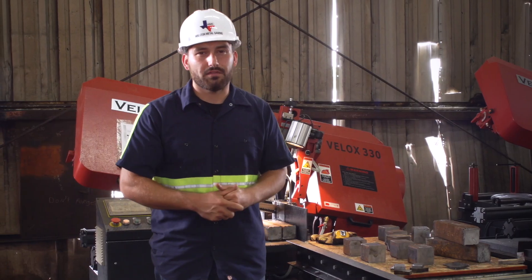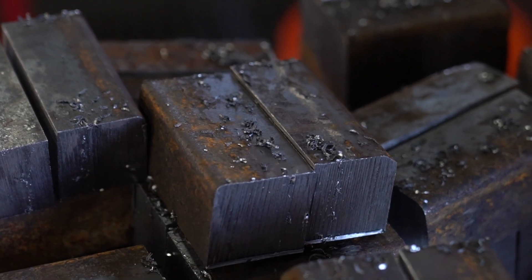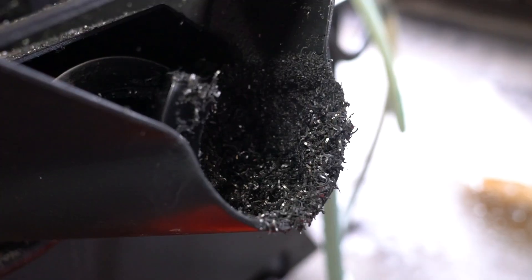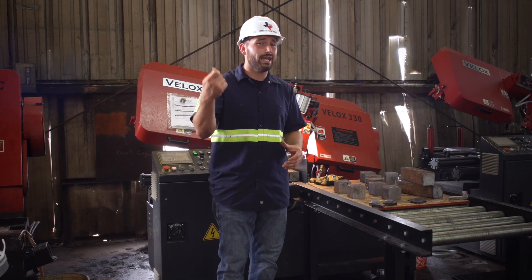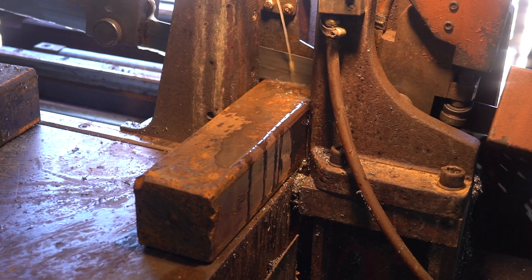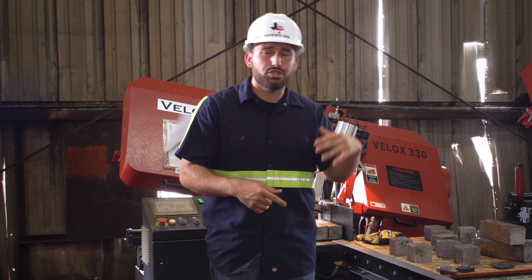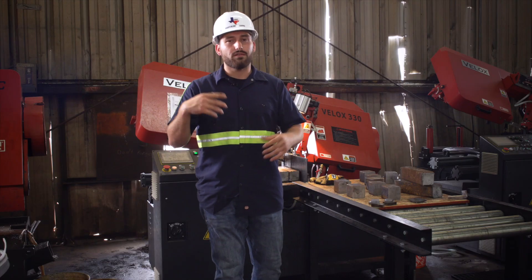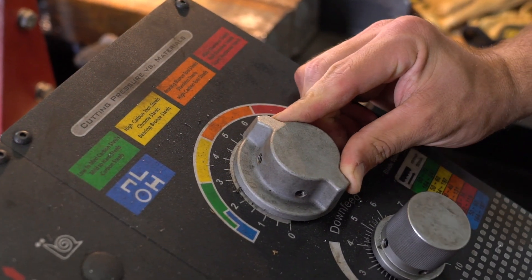As always, we're going to take it one step further and assess the chips. Cutting cast iron is a lot like cutting a low to medium carbon steel, so we're going to be watching for that straw brown to medium brown chip. We really don't want any high blue color in it — that tells us we've fed too fast on the feed rate and cutting speed, so we'll want to turn that back down. And as always, you don't want a stringy chip, because that means not enough feed rate. If you have a real tight curly cue, you've probably got too much pressure and feed rate, so slow that down as well.